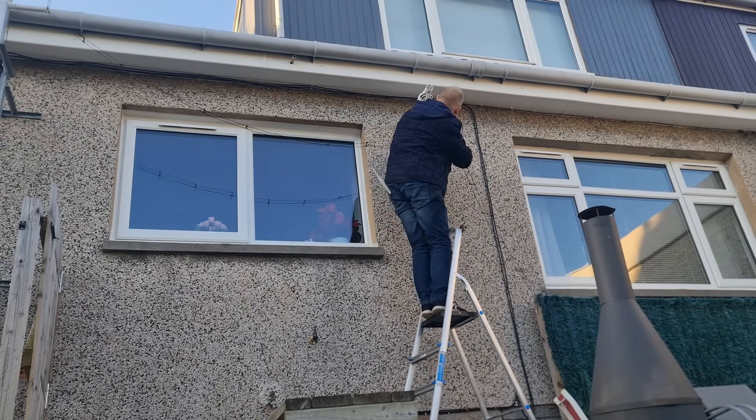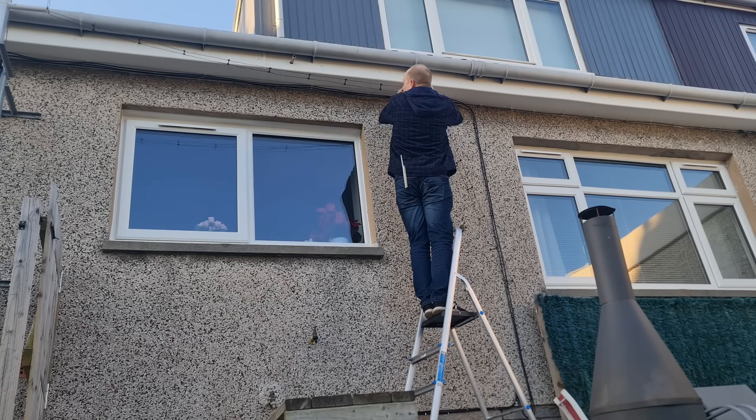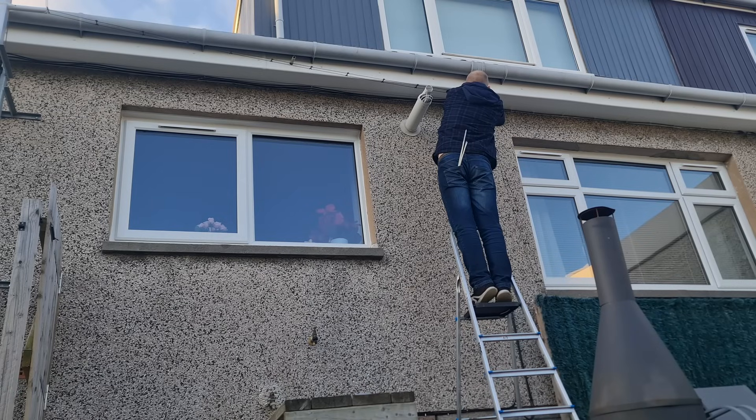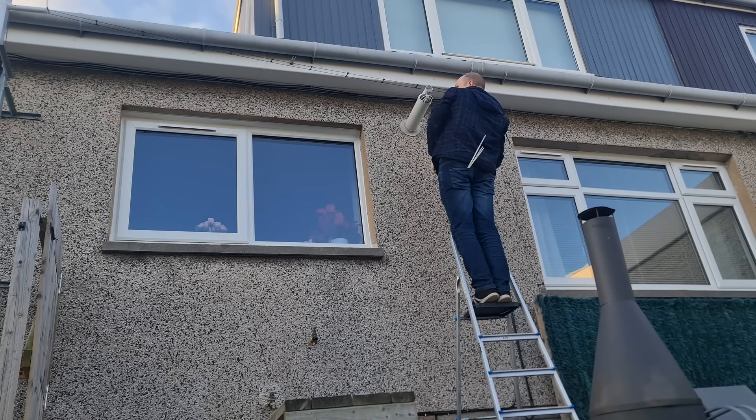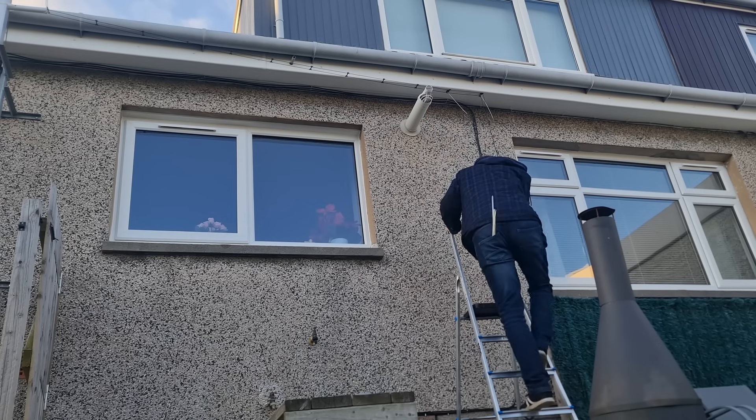This job took me a little bit of a while putting up the ladder line. What I didn't show you in the video was, initially I used 11.5 metres of ladder line and I couldn't tune a lot of the bands — I'll touch on that in the lessons learned at the end. But I just used some scotch pads, stuck them on.